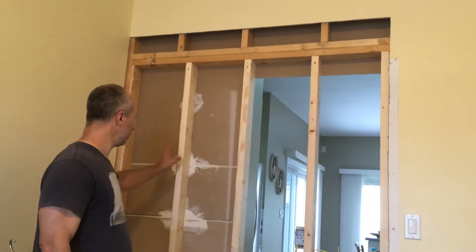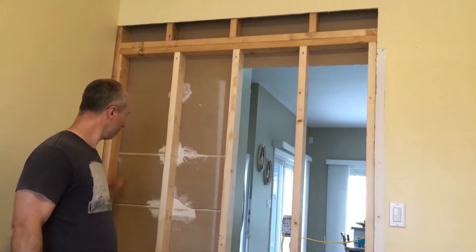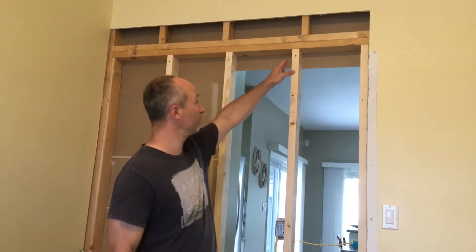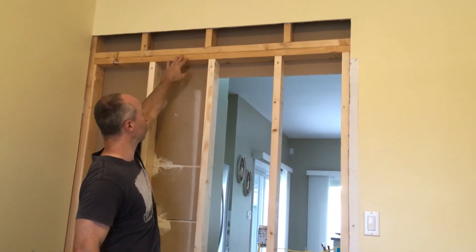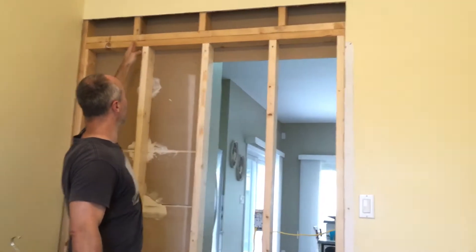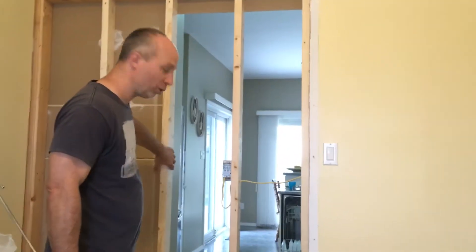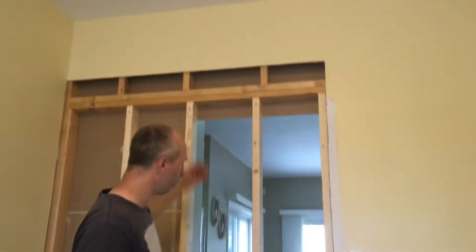What we've done right now is I've framed this wall. Normally you've got a certain spacing between each of your studs, but in this case I didn't use the standard spacing because there used to be a sliding wall here and they didn't do it properly — these two by fours should have been the other way. I decided to put a two by four here so there's something to screw the replacement piece of drywall into.